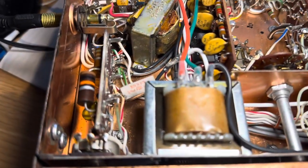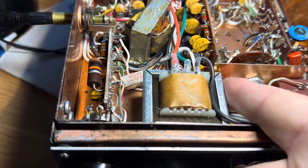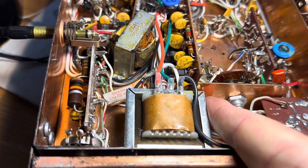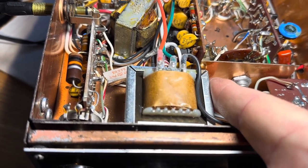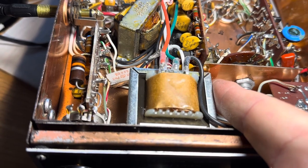There are two six volt taps here for each half of the radio. This transformer is now powering a number of the tubes. And the 12 volt line is going right to the calibrator — I made the wire too short, so I put the wire right on the 150 ohm resistor on the calibrator. That has a diode and rectifier built in. This thing will put out about an amp, I think center tap. I wonder how it's going to hold up — it's getting a little warm. We'll let the radio run for an hour and see how hot things are.